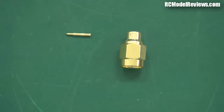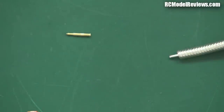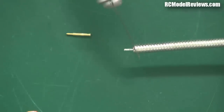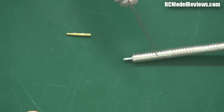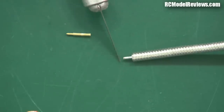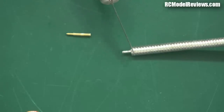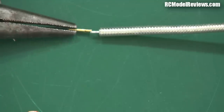Putting these together is actually incredibly simple — no special tools required, just a soldering iron, a little dexterity, and a bit of practice. The first thing to do is cut your coaxial cable. In this case I have around four millimeters of inner wire poking out past the braid, which I've cut back. The inside conductor is a solid conductor, there's a braid on the outside which is all soldered together, and we've just got that inner poking out with the insulation and braid cut back.